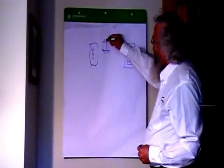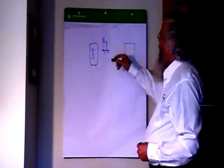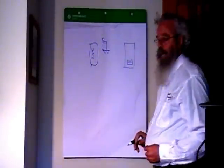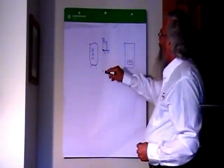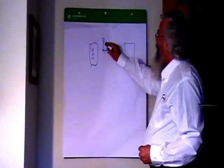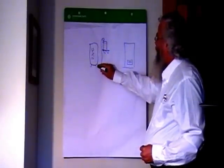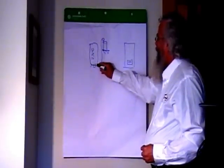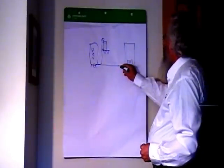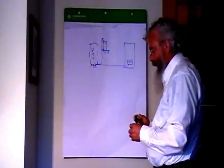On top of the tank is the mounting bracket and then the metering pump. That's essentially the physical arrangement. There's going to be a draw tube that comes up into the metering pump and a feed tube that comes down and T's in. Out of the oil tank there should be a filter and a line running to the furnace burner, and you'll put a T after the filter.